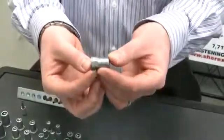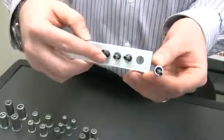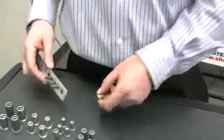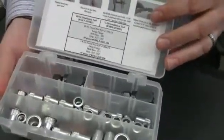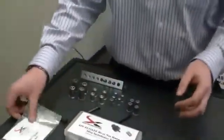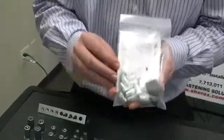A Half Hex product is also available for increased spin-out resistance. A Riv Float stud is also available to offer a studded attachment point instead of an internally threaded attachment point. For maintenance, repair, or research and development applications, Sherex offers kits with an installation tool along with 15 to 20 samples, as well as individual size bags with the installation tool in quantities of 15 to 30 pieces.